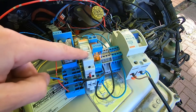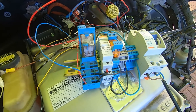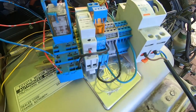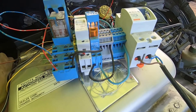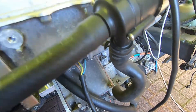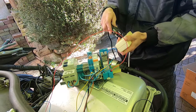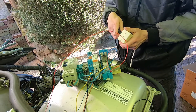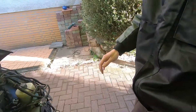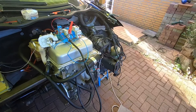That then switches a larger contactor. This step is a bit redundant — it's simply because this relay can only handle 10 amps and is too weak for the charging current. So we have this additional relay here, which would normally output our 230-volt phase. And that's where we'd normally connect our input as well. Here's my socket. Everything has switched through now, and we should see the charging current rise — and there it is. Now with the correct voltage — yes, we're there.